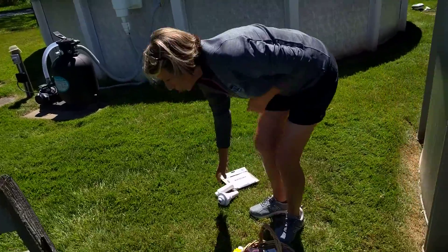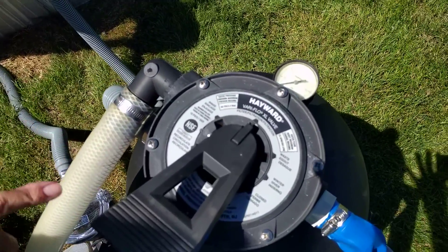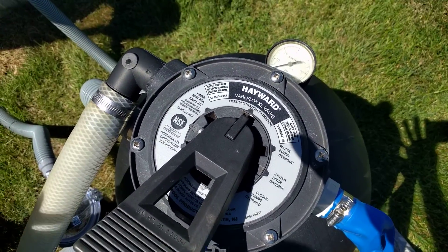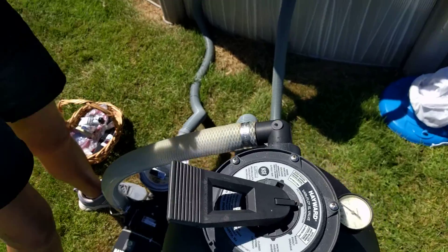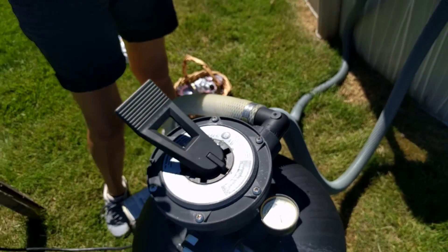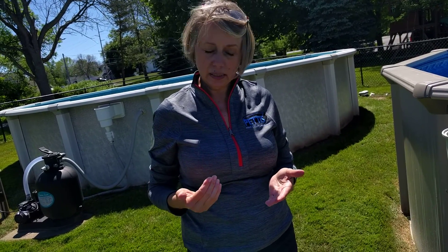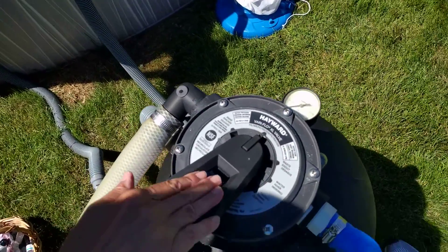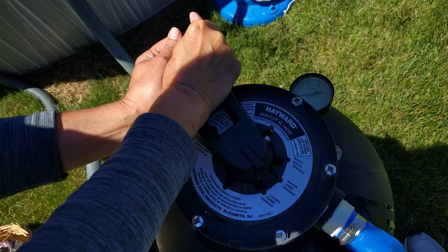Let's go back to the filter. We talked about the multi-port — I'm going to turn this off so we can hear a little better. Again, 99% of the time you're going to be on filter or filtration. Your sand is going to catch on to organic material, and as it catches on to stuff that's filtering through, it's going to raise the pressure in your sand. So always check your pressure gauge — whatever is normal for you is going to be normal for you. Most people run somewhere between about 12 and 15 PSI. Once you get 10 points higher than what your normal is, then you know you have to backwash or clean the sand. Every time you change your setting on your multi-port, you're going to push down — clockwise — and right now we're going to go to backwash.